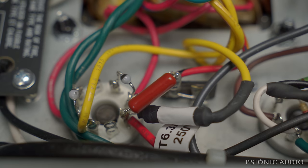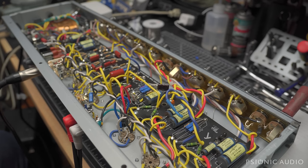The same way this amp has the so-called 'custom tremolo' — it's not custom, it's just the one ripped off from the Princeton. It's a bias-wiggle tremolo so they don't have to use the opto, because the opto has an LDR containing cadmium which they cannot sell in Europe due to toxicity. So they can't sell the traditional opto tremolo on this model in Europe, so they use the Princeton one which doesn't sound the same — and voilà, it's 'custom'.